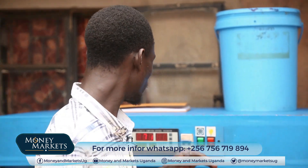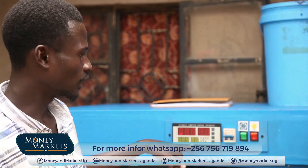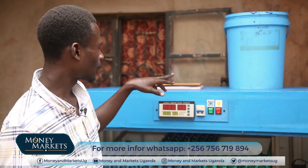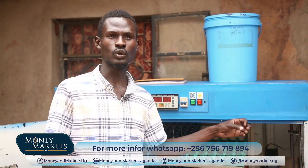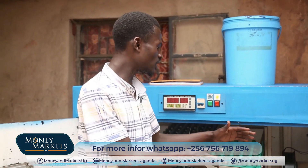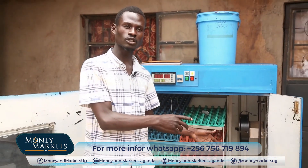For example, in case the humidity goes above 60 — it's supposed to be 60 — if it goes above 60, the second heater is switched on to suck out and reduce the humidity. If the humidity is okay, one heater is put off.